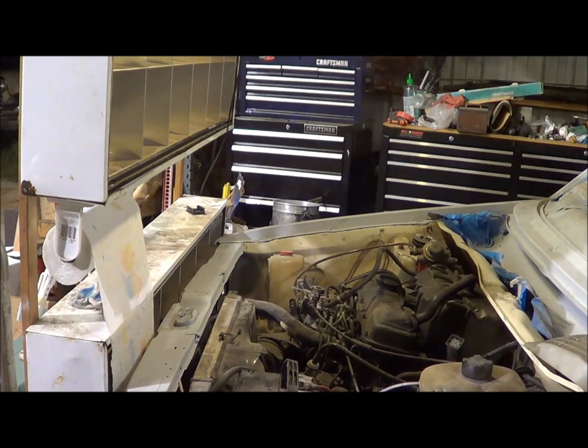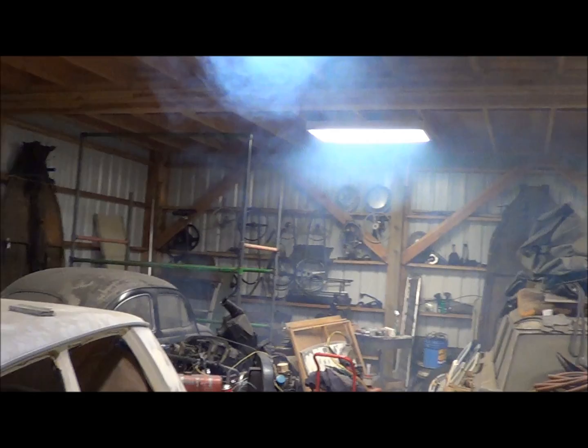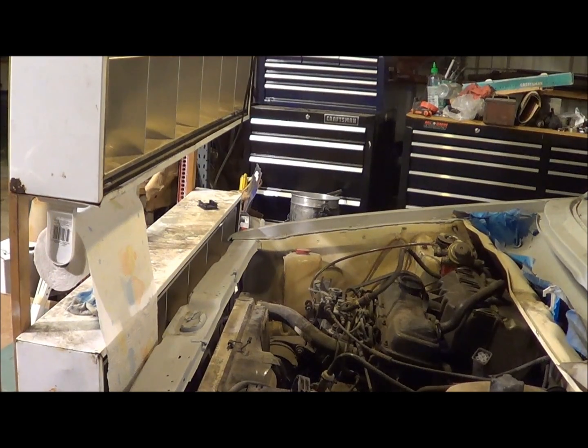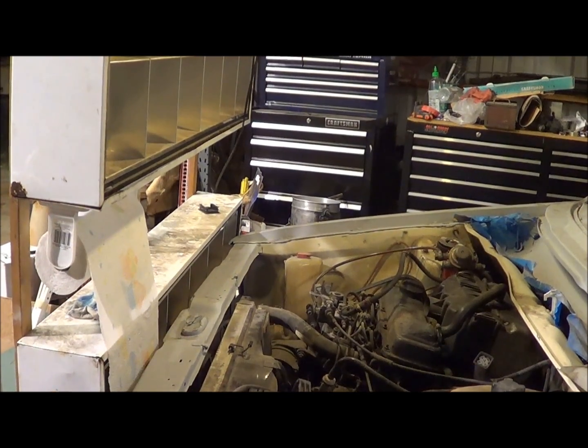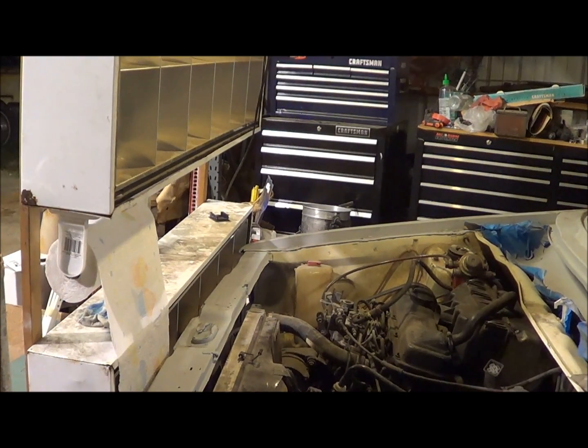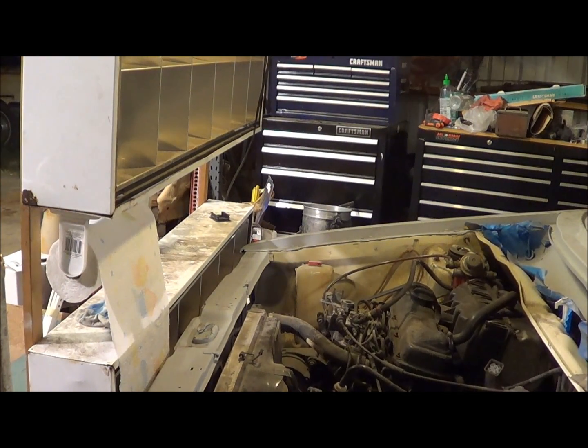Cold start! We'll look at the exhaust here — not too awful bad. I think it's still running on like three cylinders, so one of those injectors needs to bleed out. If I let it run a while it will probably bleed itself — I shouldn't have to crack it to bleed it. I'm going to get it to run and warm up a bit, and push the retard in here.